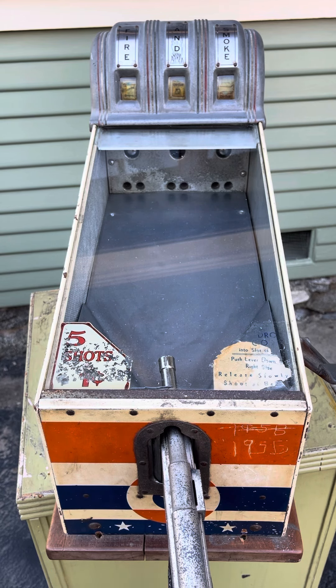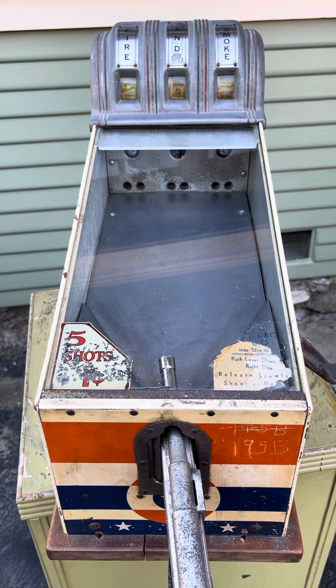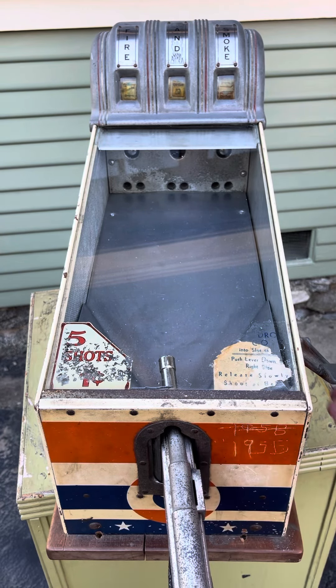There were some alternatives that had red, white, and blue colored targets — a patriotic theme — and some other derivatives as well. The neat thing about it is it's an entirely mechanical, clockwork inside that's driven by a spring. When you put in the penny and push down this handle on the side, you effectively crank up that clockwork, and then the spring winds it back. That activates the chain drive for the reels, and there are three larger targets inside that you aim for to try and hit and stop the rotation of the reels. Let's go ahead and play it.